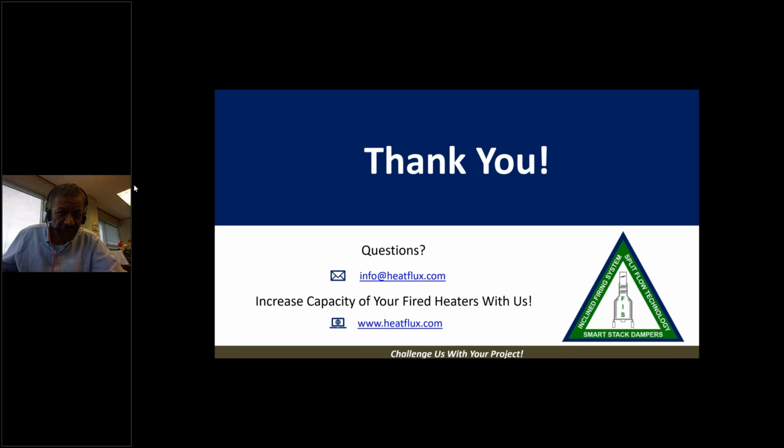What are the methods to control tube skin temperatures? Only by adjusting the firing in the burner or any other method, when the burners have adequate capacity? So this webinar which we are doing today is mostly for split flow capacity, but we will definitely have another webinar where we will discuss the burners. The main thing is you have to make sure you don't get any flame impingement. And that's what we will focus on in our next webinar, how to make sure you don't have any flame impingement and you can lower your tube metal temperatures.